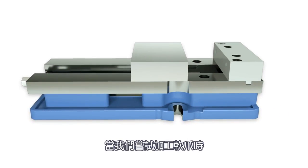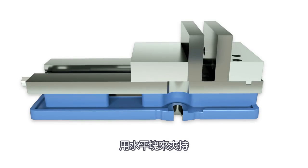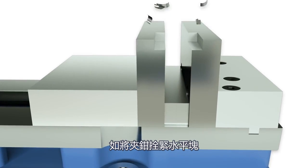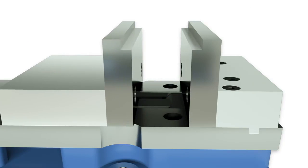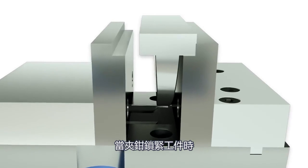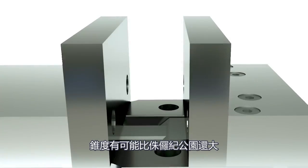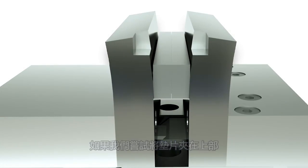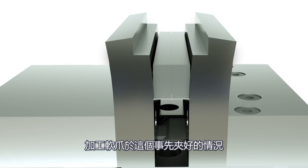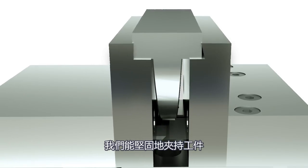Here's an illustration that'll show you exactly how this taper occurs. If we tried to machine into our jaws without them being clamped on something, the floating jaw would just bounce around, giving us a terrible cut. Clamping on stacked parallels creates the perfect spacing that we need. If we tighten the vise with our parallels near the bottom of the jaws, they'll cut just fine — but it is possible to end up with tapered jaws that don't grip our parts evenly. As the vise tightens against our actual part, the jaws deflect by some amount. With taller jaws, the taper can be drastic. If we keep our spacers near the top of our jaws, we'll end up with a better part fit. Cutting the jaws under this pre-loaded condition will eliminate gaps and jaw taper — when we are firmly clamped on our parts.